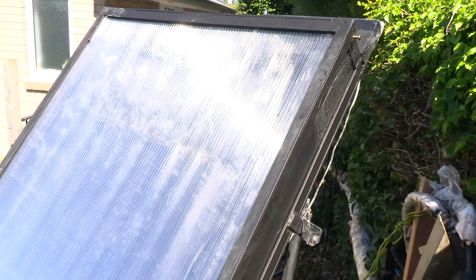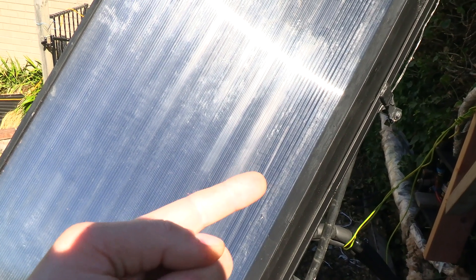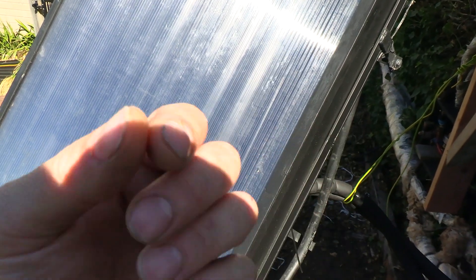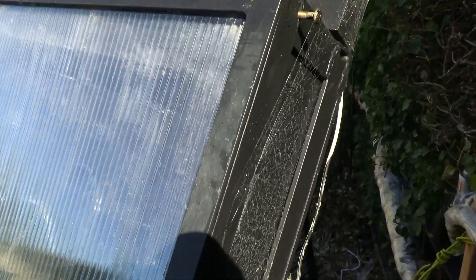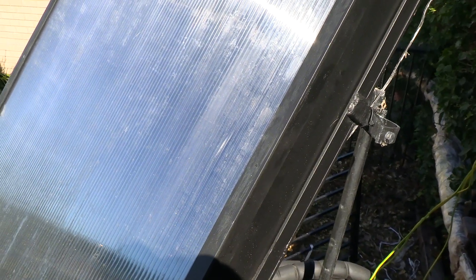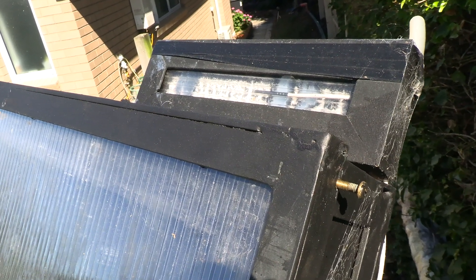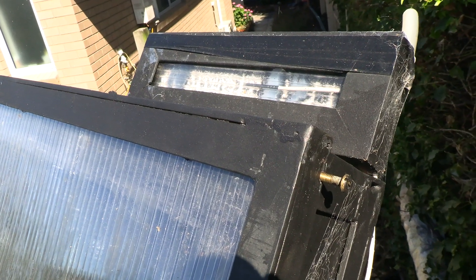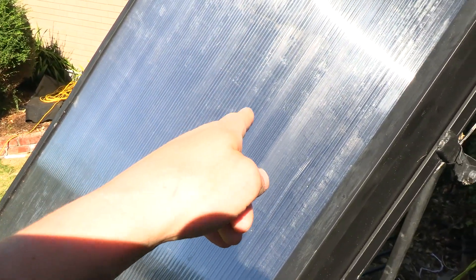The way the thermostat in the collector works is I can't put the thermostat inside the collector, because the warm water flowing through there — when the sun goes away it's going to be hot and that thermostat won't detect that it's gotten cloudy. It will just stay on because it will be measuring the temperature of the water flowing through rather than the heat from the sun. So for that reason the thermostat is at the top in a little channel. When it heats up in the sun, it's like a little mini greenhouse — that detects the sunlight and turns it on. When it gets cloudy, the little mini greenhouse cools down and turns off. So that's the thermostat control for the collector — I can't put it in there, it's got to be in there.